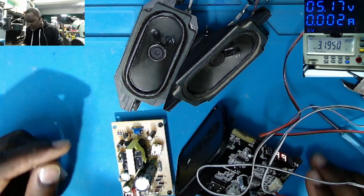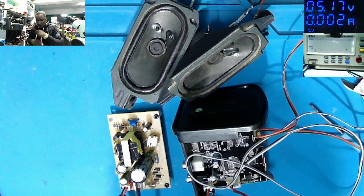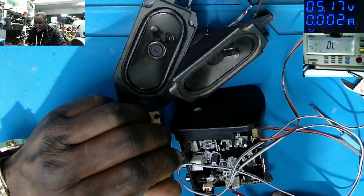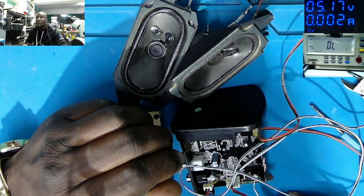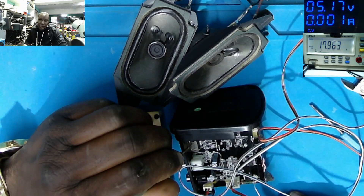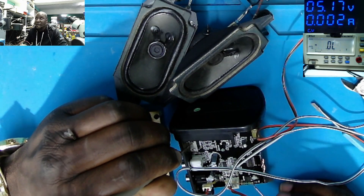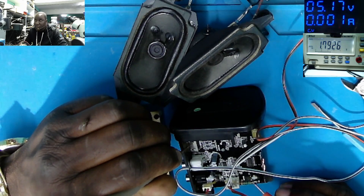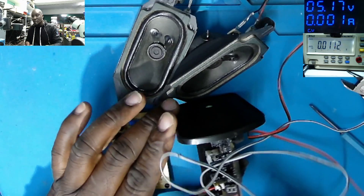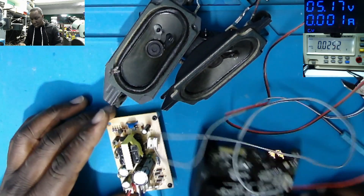It's working, and our regulator is quite cool. Let's check the voltage after the resistor — this is just a 10 ohm resistor, so I don't think it will change 18 volts much. On the input: 18.22 volts. On the output after the resistor: 17.96 volts. There is a slight voltage drop after the resistor — that is supposed to happen. On the input of the regulator we have 17.96 volts; on the output, exactly 5.05 volts. The Bluetooth is still on. That was the repair — our problem was the resistor.